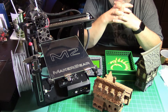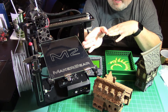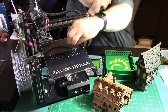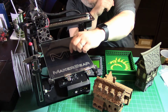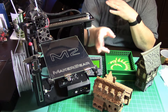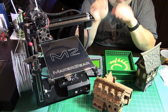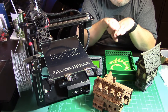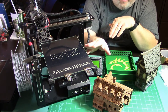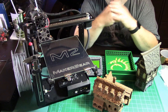The print just pops right off the glass once it's cooled because it releases the PLA. But if you're on a weekend with a print job finished, the tendency is to come over and grab it and pull - you're going to get a bunch of resistance if it's still hot. When you pull it, it can tilt your build platform, which can cause it to go out of level. Take your build plate off the build platform when you take your piece off. That's the biggest piece of advice I can give you. Once your Z height is set and your bed is level, if you do that it's going to be months in between leveling.